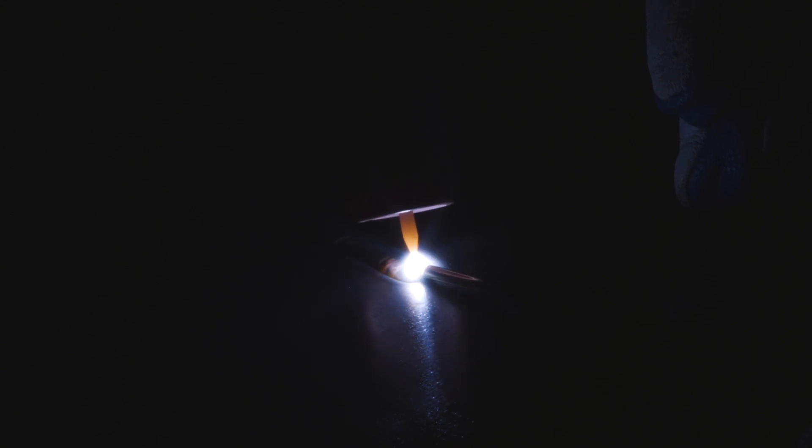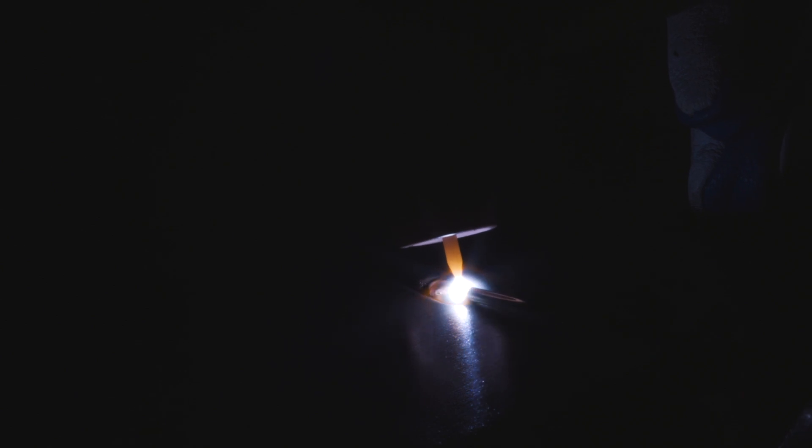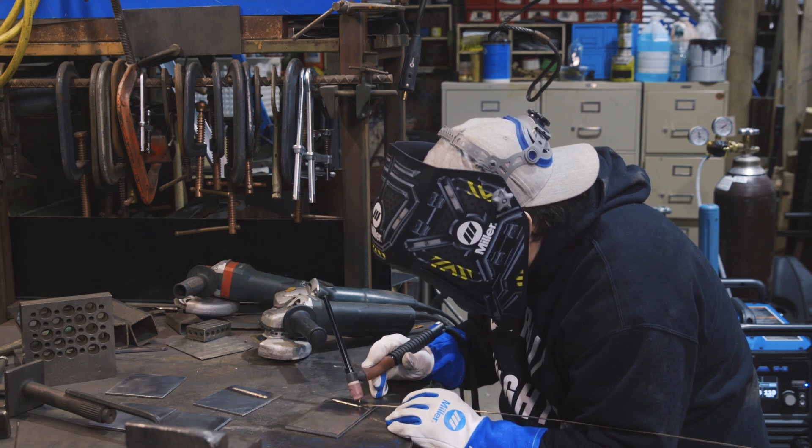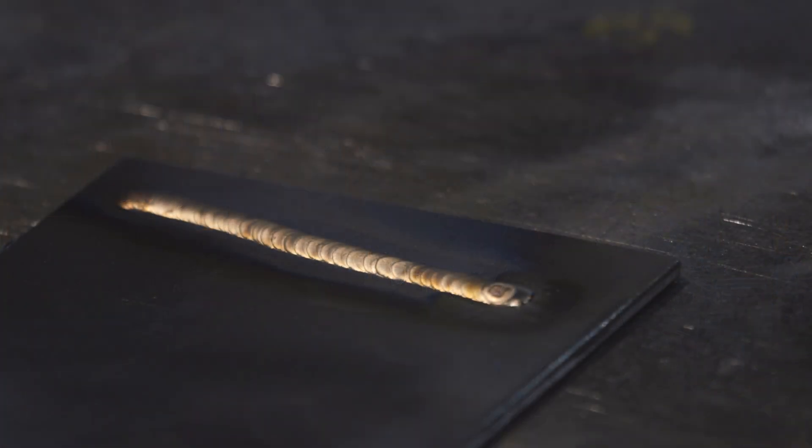You've got that nice clean center. Then coming off of it, push a little filler in there and come off to the side — otherwise it'll want to crater. So that's just a brazed bead run with silicon bronze on DC.